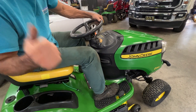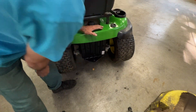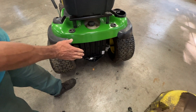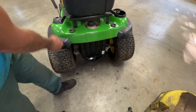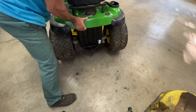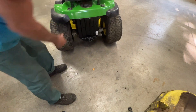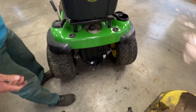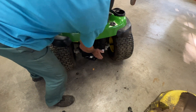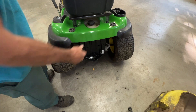There's one thing in the back here — this is a neutral rod that needs to be in. So two things to check: make sure the neutral rod is in and the brake is off. You can push back and forward on these, but if you pull this out, it's in neutral. Always push that back in — otherwise you'll be wondering why your John Deere isn't working for a minute or two until you figure that out.